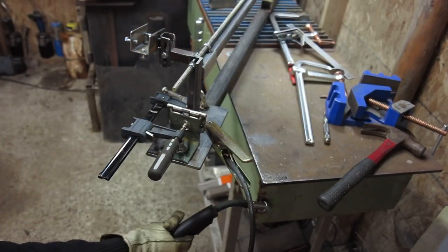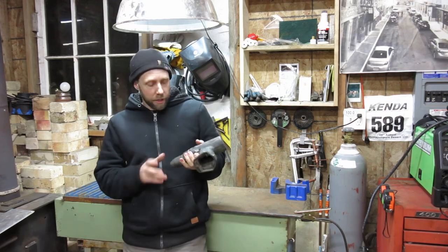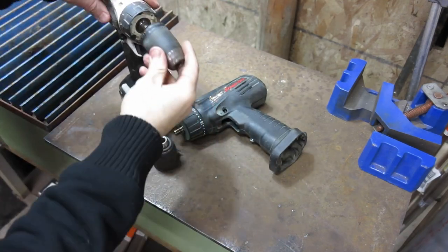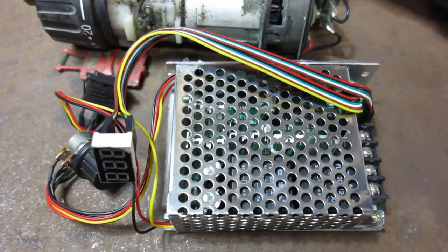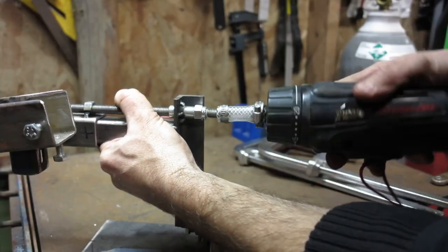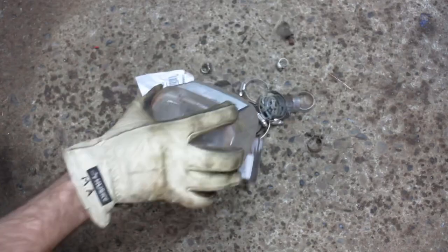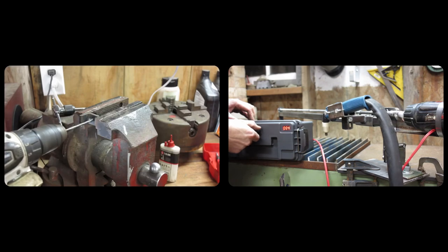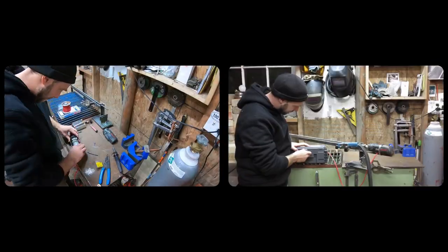I think running it with a cordless drill is perfectly fine — any cheapo drill should work fine for the motor drive. But I'm going to take the chuck off this and transfer it to my other drill since the first one was all jacked up. Basic drill motor and a pulse width controller — very simple. Inside this box is a pulse width controller with a digital display, so when you vary the speed you'll kind of know what optimum speed you want to cut at. I can also put a return-to-home button and a limit switch so if I want to cut a four inch cut, it'll go four inches and stop.